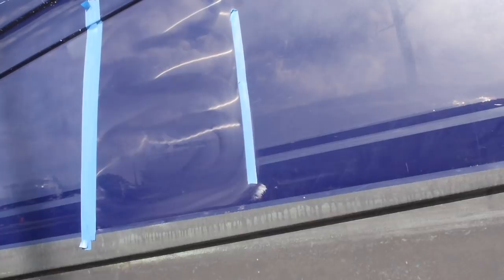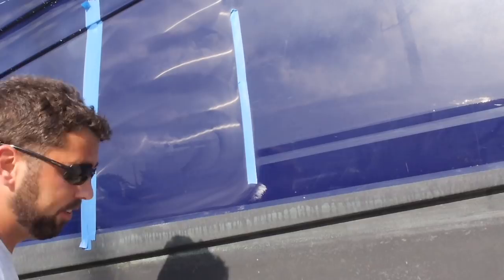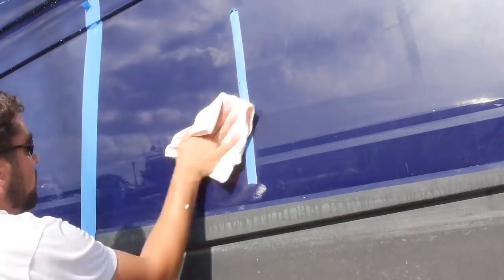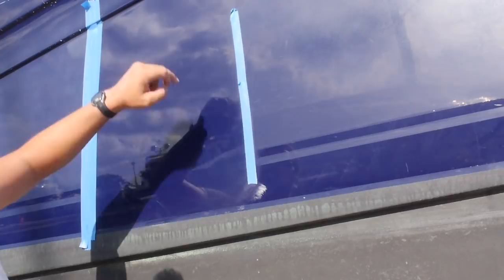Let's give her another wipe. You can see the grease coming off is actually blue — that is old, dead, oxidized gel coat coming off. Don't be afraid of that. We have a better reflection. These scratch marks are starting to show up even more prominent. This old repair is going away more. We just have a better reflection overall.